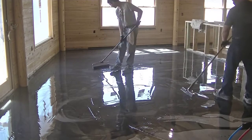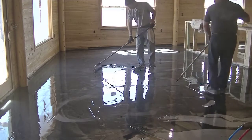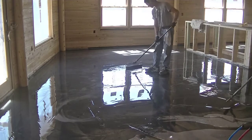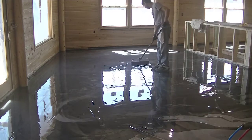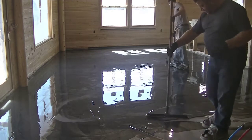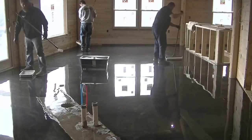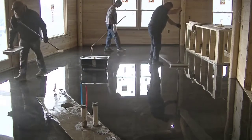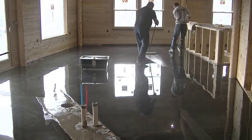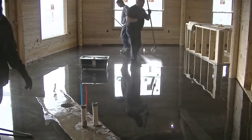I'm going around with an 18-inch roller, just moving it around a little more, making sure it looks kind of natural, and then we just leave it and let it flow on its own. I could use a six-inch or nine-inch roller, but since it was three thousand square feet I decided to use a bigger roller for the final spreading. The next day — day four — we're putting on the clear top coat. You can see how nice and smooth the epoxy dried; it levels out just like glass.